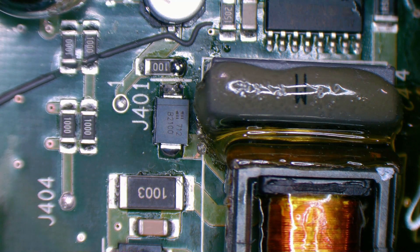I'm wondering if the other diode I used, which tested okay, might not have been rated to a high enough current. I can't imagine it's pulling anywhere near 2 amps through it, but anyway. Hopefully that helps you figure out your unit, because I couldn't find any information or other repair guides for these anywhere. Either they don't fail often, but there do seem to be a few people with a dead unit. Hope that helps — thanks for watching.